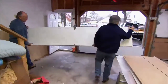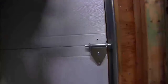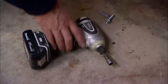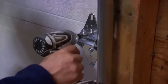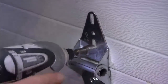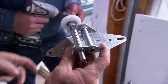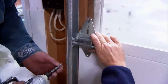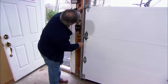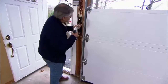Walk towards the stairs because I've got to turn the door into the track. Now walk the door into place and drop it down on top of the first panel. I want to make sure the two panels are flush on the end, which they are. I've pre-drilled the hole for my lag screw so when I tighten it, it will pull the door right into place. Now I want to make the track parallel with the edge of the door — I'll eyeball it so the space is equal, then tighten up my lag screw.